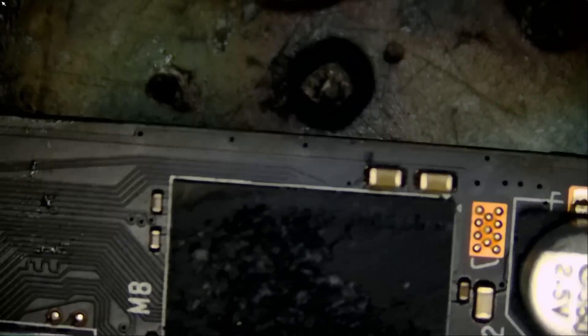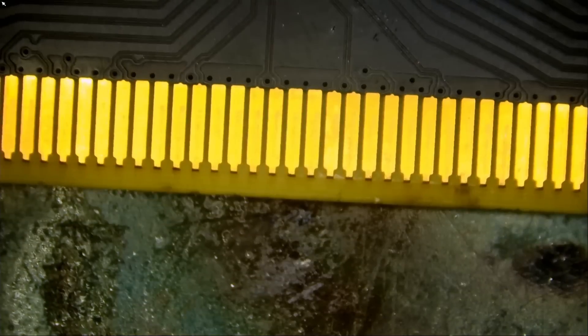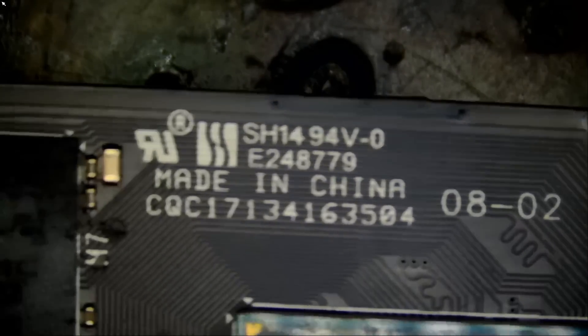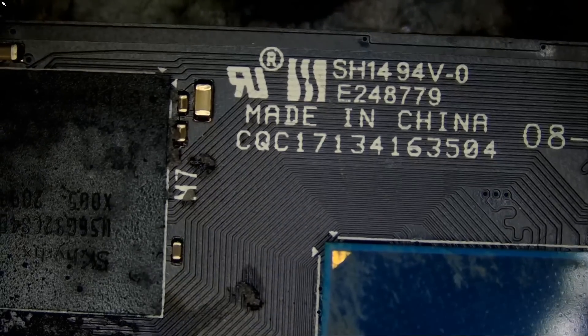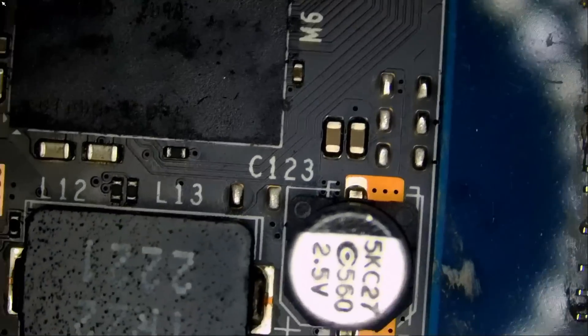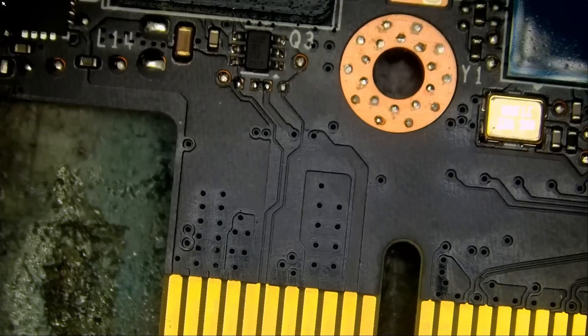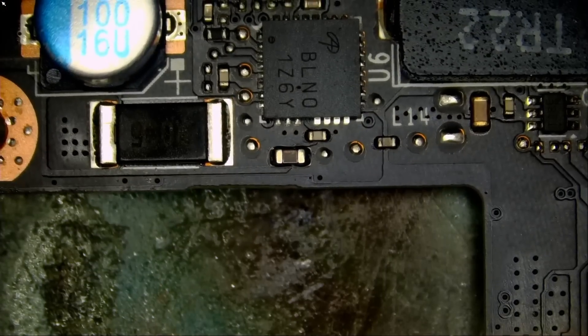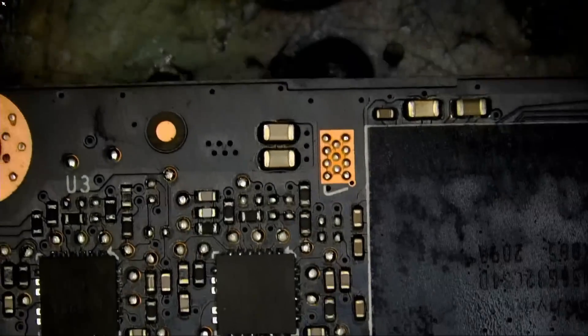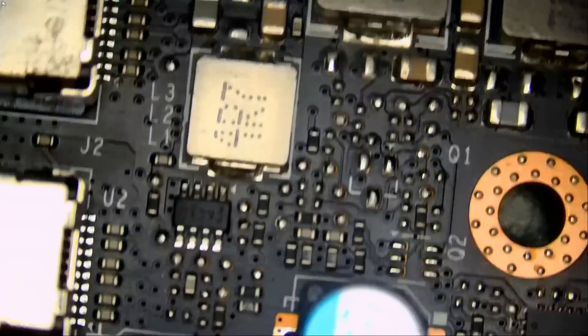What can possibly go wrong? Memory or core? What else? For the most part, unless you are working with an EVGA 3090, then you can be 90% sure we're going to have a shorted 12-volt rail or a blown fuse on the back of the board.